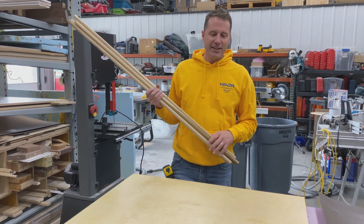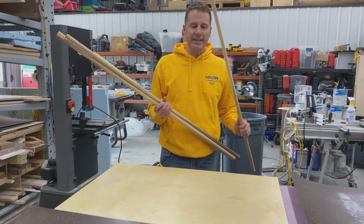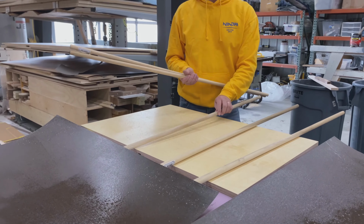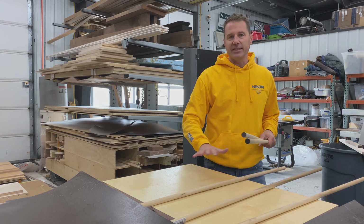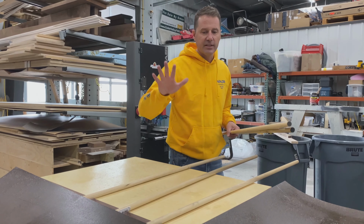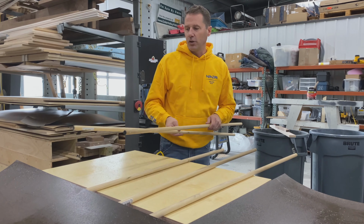Okay. All right, so on the smaller pieces, I can just place those, no problem. Anything bigger, this is more like a countertop or something. So what I'll do is I'll put these wood dowels out here and I'll space them close enough that when I put the laminate on it, it can't touch. That way I can position the laminate and then pull out one stick at a time and stick it across. Because with the contact cement, as soon as there's contact, it's over, it's stuck.